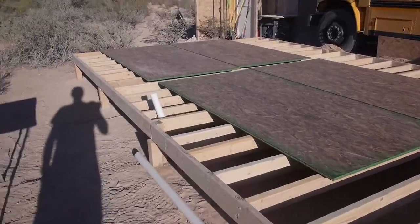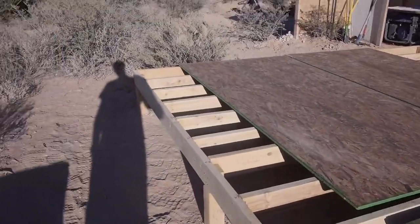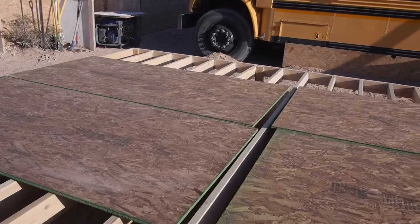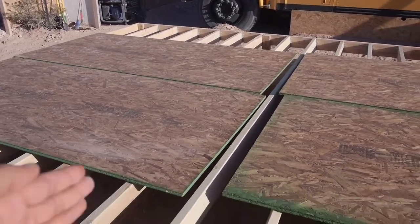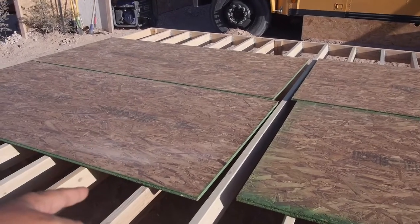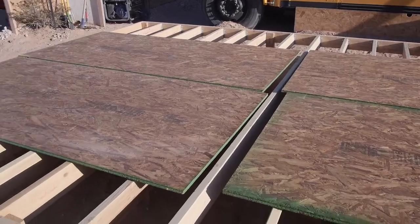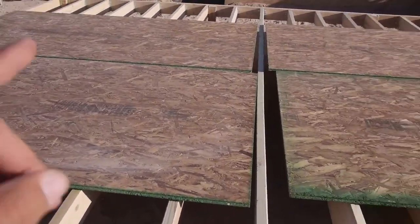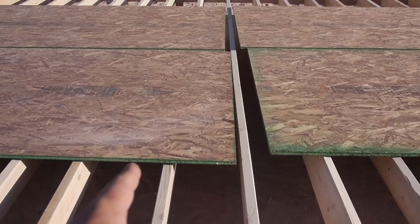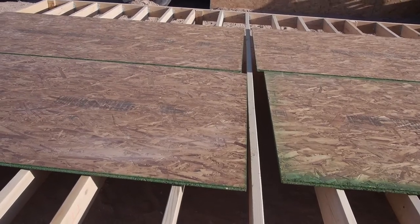So I'm going to try to do a minimum of cuts. It's just more than 3 wide, and my joists don't always end on the end of these, so I'm going to have to end up cutting them short and then adjusting from that. Worst case, shortened subfloor is going to make wonderful countertops and workbenches, so I'm not too worried about that.